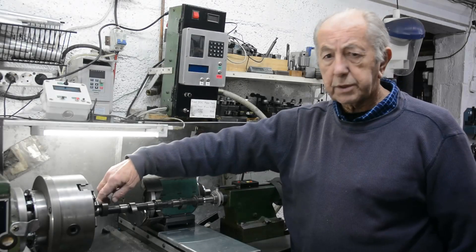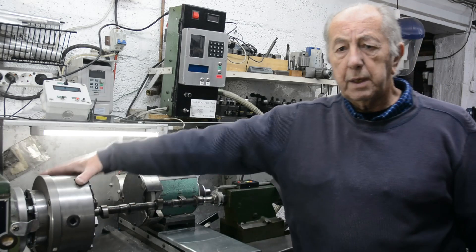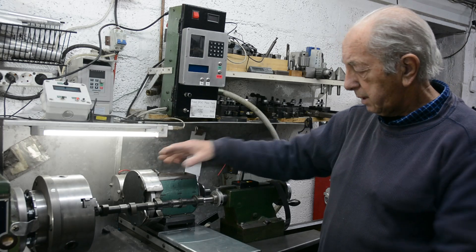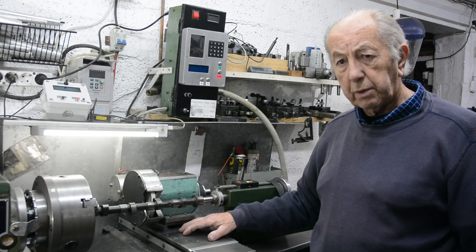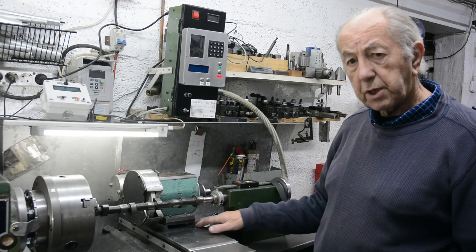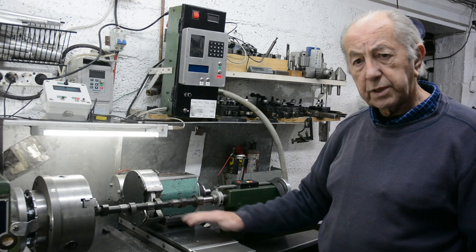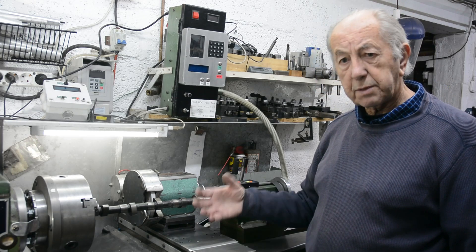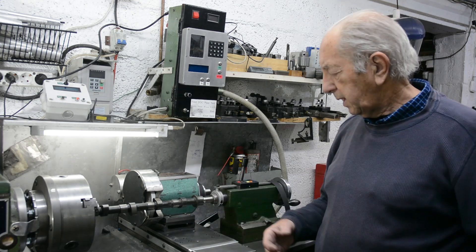The way in which it works: I've got a camshaft which is driven by the lathe spindle grinding head here. This is mounted on a new cross slide that I put on, which instead of running on normal dovetails runs on linear ball rails. You get a very silky smooth motion on here so that we're transmitting the minimum of roughness into the final cam.